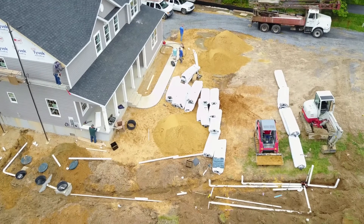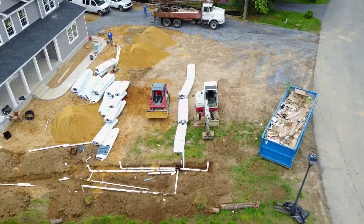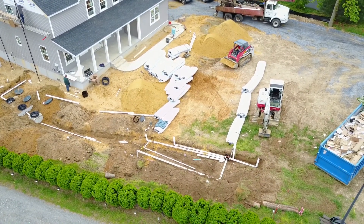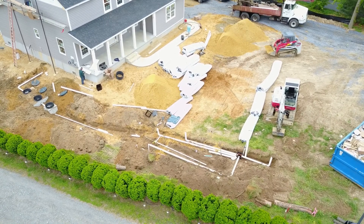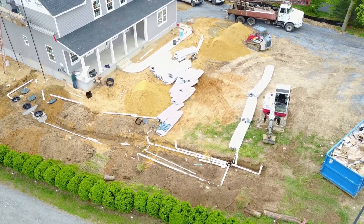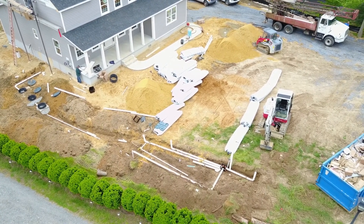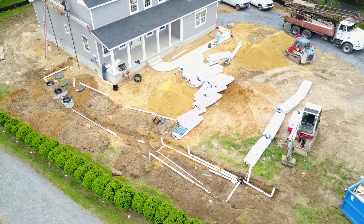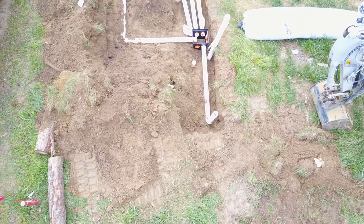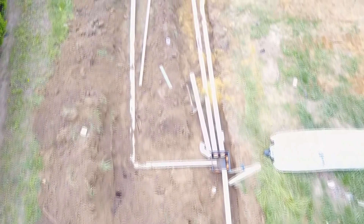Here's another aerial shot after we've got everything set up — the D-box is in, the headers are in, and the pressure line is in. We need 25 feet of gravity pipe connected after that pressure line. In other words, we connect the pressure line to gravity pipe and then need 25 feet of that gravity pipe before it connects to the D-box. We gate that down with a valve and ensure it is a gravity flow reaching the D-box, and we do all that before we leave the site.